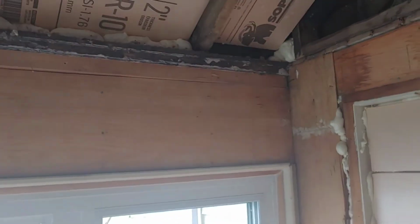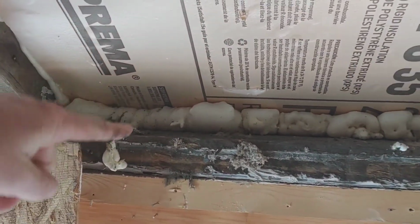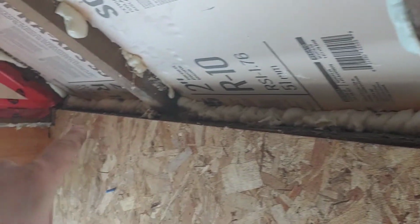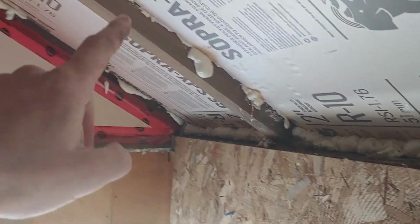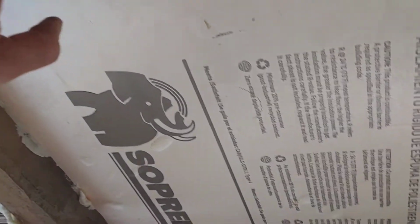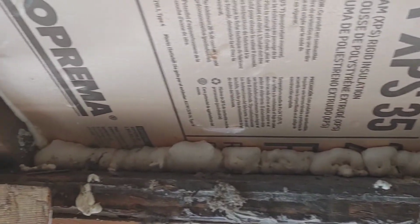But it's going well. I didn't do a lot of work yesterday. I'm kind of limited in what I can do. I've also gone up here. I'm just going to climb on this ladder. Where the rafters meet the sill up here, I have sealed all this cavity in. I've sealed all these cavities. So far I've got 2 cans of foam invested in this. They're about $10 each, but it's well worth it. This is still a cheaper alternative than spray foaming or having a company come in and spray the expandable foam on. That's very expensive, but you get kind of the same results with this.